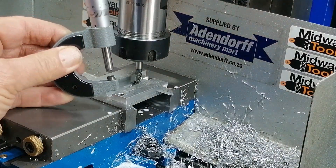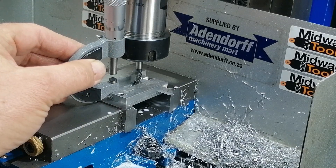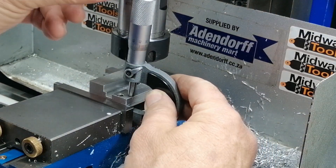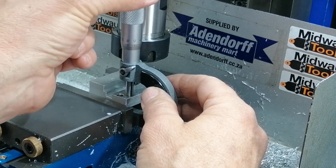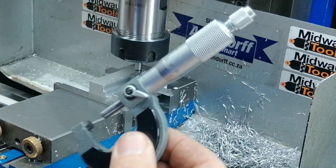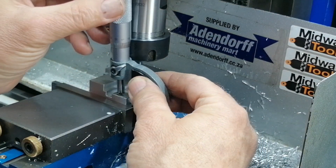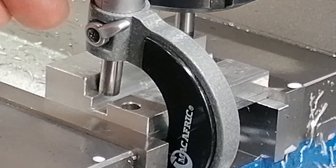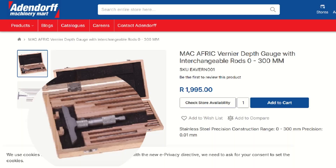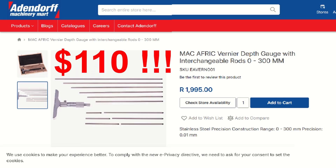You could try using a micrometer, but that's not what it's made for. You could measure above and inside the slot, then subtract — technically possible, but useless if the slot is narrower than the micrometer shaft. A proper depth micrometer would be perfect, but they cost an arm and a leg and I still need mine.